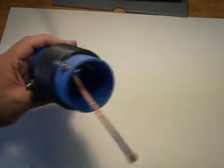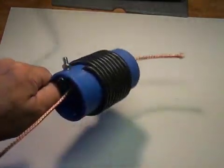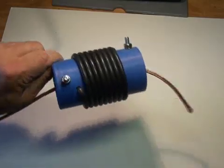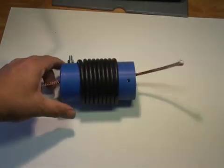What you see here is the trap just prior to it being soldered up — it's in the construction phase. When I've completed it, I'll put it on the RX1 bridge and test to see if it's resonant on the frequency stated in the handbook, which is 7.15 MHz.